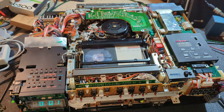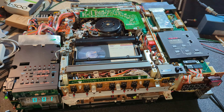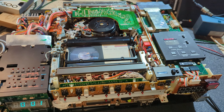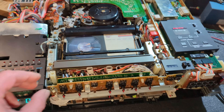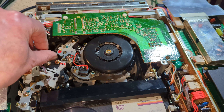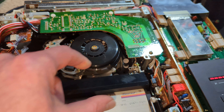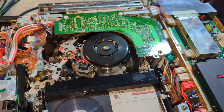Hello and welcome to another Mr VitaPike video. This one's a little bit different insofar as it's part three and hopefully the last part of getting this new old stock C7 up and running. It's had quite a few interesting issues - I'm still struggling a bit with the lacing and unlacing, and you can hear I still haven't properly lined up the gear on the capstan pulley. You can hear the squeak from that motor, and we do have rewind issues.